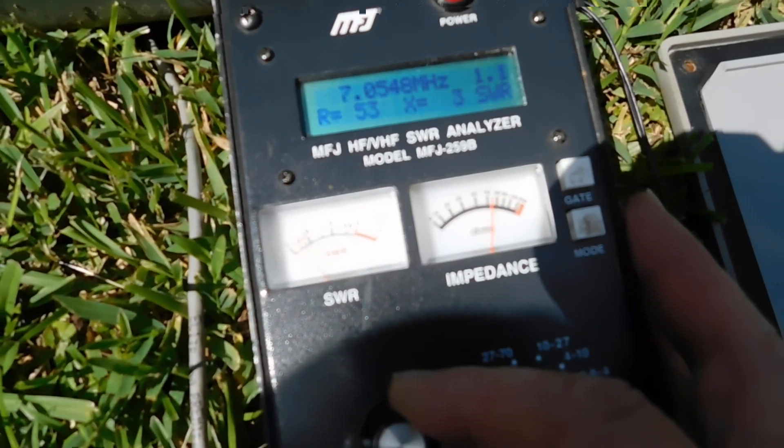Anyway, that's the quarter-wave verticals — I've been using them for a few years now, all made out of scrap aluminum, and really excellent performers. Let's go down to CW, just for a minute — this is where I usually use them, down here in the extra part of the band. You can see a little bit clearer on the pan adapter — that's the verticals. See how the baseline drops with the horizontal receiving antenna. A little bit noisier on the verticals, but it's got some gain and it's got some front to back, and it comes in real handy.